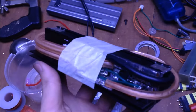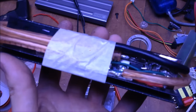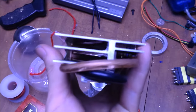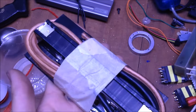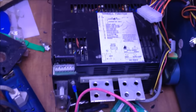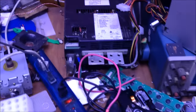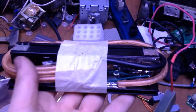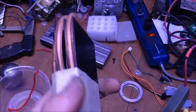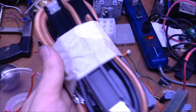Okay, so here I built a significantly bigger ZVS drive. It's on the larger MOSFETs and larger heatsink. Except I don't have any Zener diodes to put on. I'm going to have to go down to the shop. And also larger power supplies too. So far the only thing I have is really the 75 amp 30 volt Lambda power supply. But I think this can go up to 75, 80. I think it's ready for 80 amps. Hence the big cables.